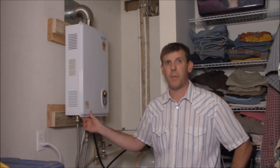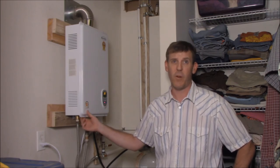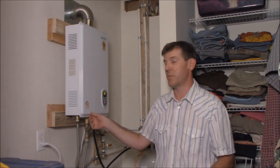A lot of people also complain about the temperature difference. If you're going to go straight from your well from a very cold water source and use one of these, you probably want to reevaluate. Maybe put the water into a tank you can store in the house, get it up to room temperature, and then boost it to the hot temperature you want from this unit. Having somewhere you can store water at room temperature and boost off of that will make your life a lot easier.